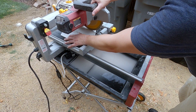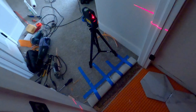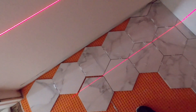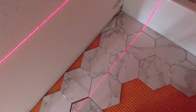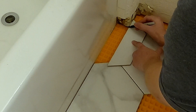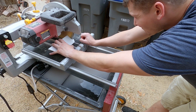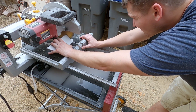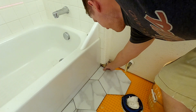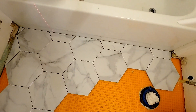I feel a lot of pressure when I have mud mixed, so I like to do a dry fit of the tile and make sure everything is cut and laid out pretty well. I use a laser guide to get the lines straight. There's a reason I started with the long wall by the door and the tub — I wanted those to look really good and be lined up square to the wall and tub since they'll be most visible. If I need to make any adjustments because the wall is not square, I'm going to hide that under the vanity and behind the toilet.